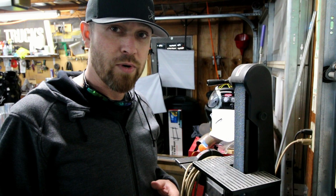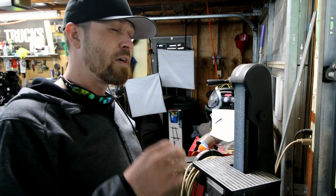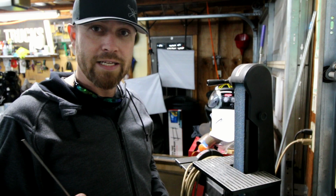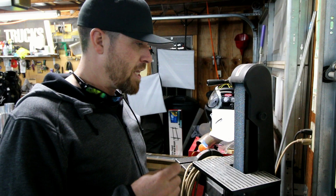I personally never have any issues with arc stability or anything like that when using this. If I'm looking for an ultra clean, smooth weld, because it's in a highly visible place and it's more about looks, I will use a different method instead of this. But probably 5 times out of 10, this is where I go. Trying to get something done, I dip that tungsten in my puddle, I just need to clean it off real quick, I come over here, buzz it off, put a nice sharp point on it, and then back to work.